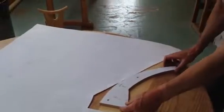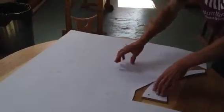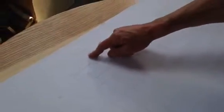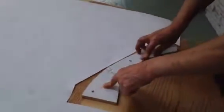I created a full-scale drawing of one of the sections. There are four sections that make the pedestal, and this particular piece we cut out of the drawing, but that's about where it was. I drew it, and this tells me where the joints are going to be. This is the upper rail, and you can see details about how the screws hold the top to the base. And here's a plan view looking at a section right through here, of the spline holding this rail to the center column. There is a spline in here too.